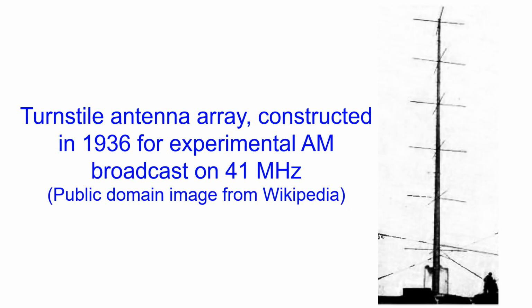While operating in the normal mode, the radiation patterns of two horizontally polarized dipoles produce an almost omnidirectional radiation in the horizontal plane. If several turnstile antennas are stacked vertically, the gain in the horizontal plane can be enhanced while reducing the radiation in the vertical direction. This is an obvious advantage in case of antennas used for television transmission. They can also be used as omnidirectional antennas for VHF and UHF transmission in amateur radio when one is not planning to work satellites.